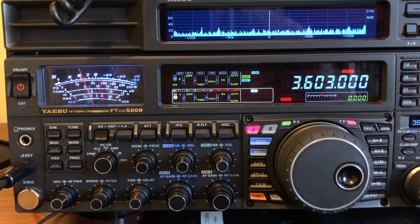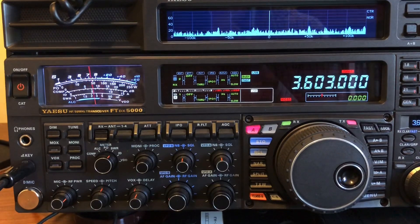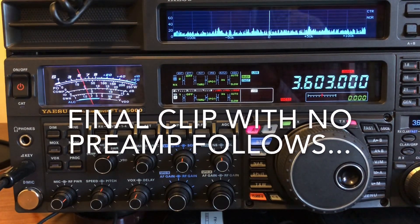Your setup will vary — this is UK soil, reasonably wet ground, good conductivity. The loop's been down now for a fair while, so it's absorbed within the grass as you saw. I've kept the demo to 80 metres; top band is completely dead at the moment, and 40 metres at 7 MHz — I've tried and there's no significant improvement there. As before, 80 was the band that I saw the most gain with the loop. The tests show the loop works in its original form and it works with a preamp. I could do with adjusting the gain to get a bit of variability, but it would mean feeding power permanently to the preamp, or popping out with a switch to turn it on and off for a listening session and remembering to turn it off again at the end.